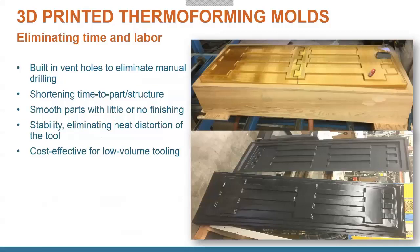You can also post-process it — once printed, if you're worried about layer lines in specific areas, you can sand it smooth after gluing it all together to ensure it's nice and smooth everywhere, with no heat distortions. It's a great cost-effective option for low-volume tooling. Since they are plastic tools, this is better suited for a couple hundred molds rather than tens of thousands. For that scenario you just 3D print it and it's a great way to get there quickly.